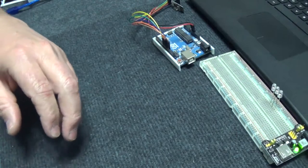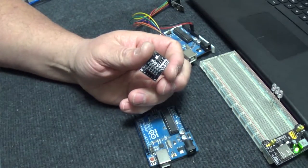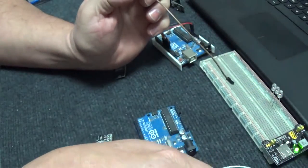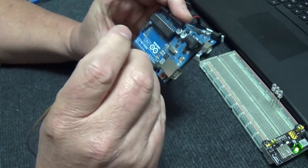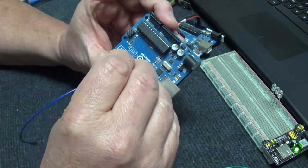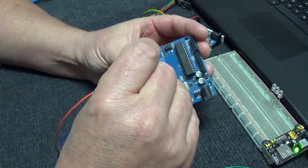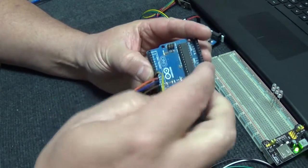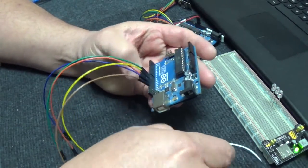You're going to take your Arduino Uno board, your radio, and your socket. I like using color-coded wires because it's easier to keep track. In this particular setup: brown goes to pin 13, blue goes to pin 12, orange goes to pin 11, skip one on yellow — yellow goes to pin 9, and green goes to pin 8.